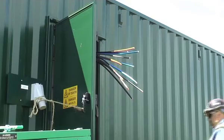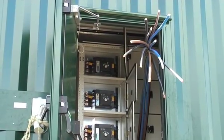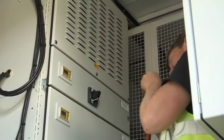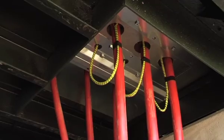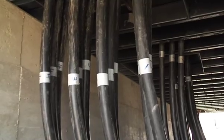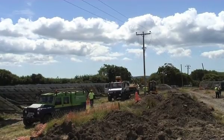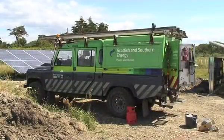Here you can see the spaghetti coming out of the door of the transformer unit — the on-site substation. All those cables have got to be fed in. You can see someone wriggling in and out of the confined space, which on a hot day is not so good. All the cables from the distribution boards come in from the inverters, go up into the transformer, and then a single cable comes out.